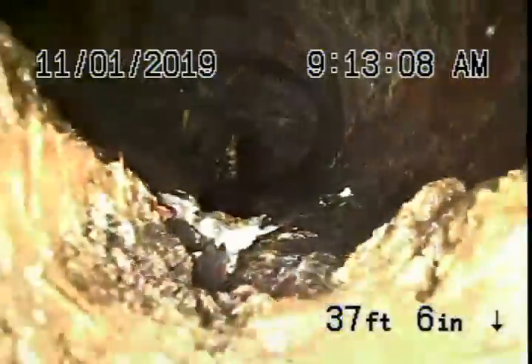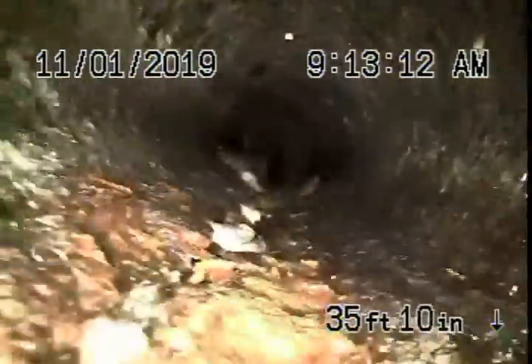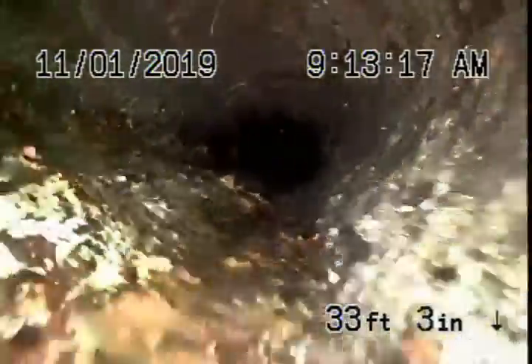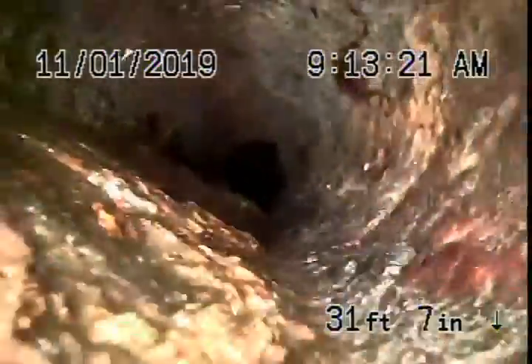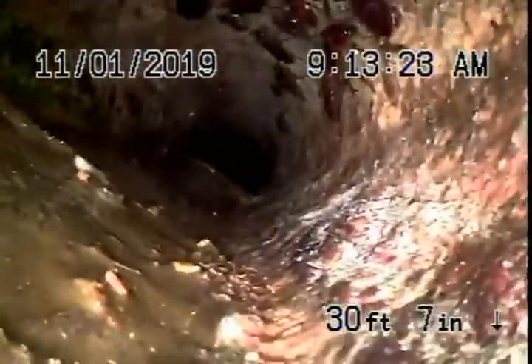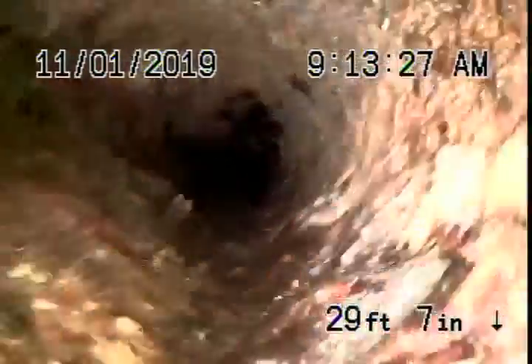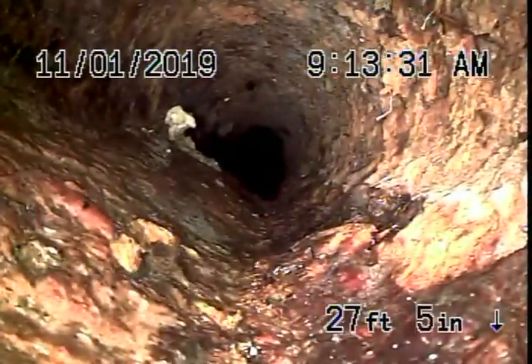As you come back in the cast iron, it's in very poor condition, this cast-iron pipe. It needs to be replaced. From underneath the house, we're probably going to need to go all the way to the property line to find the 6-inch pipe — the 6-inch clay pipe or concrete pipe — because this cast iron here is really bad. You can see it's really in poor condition.